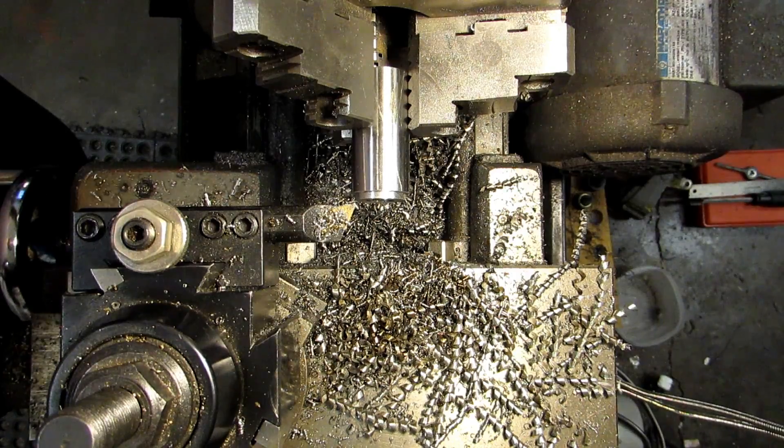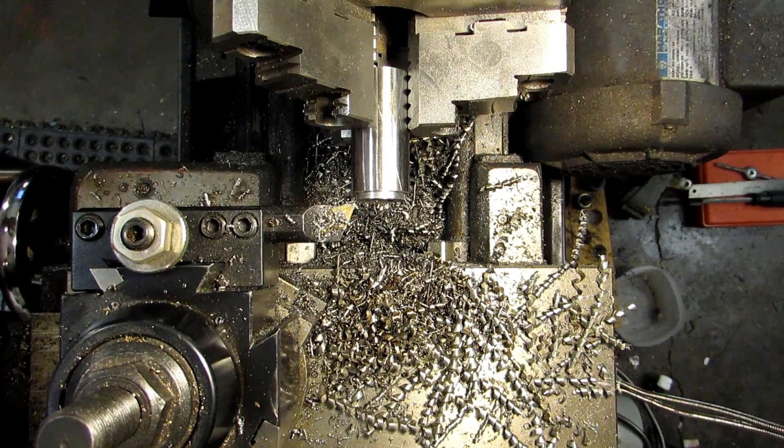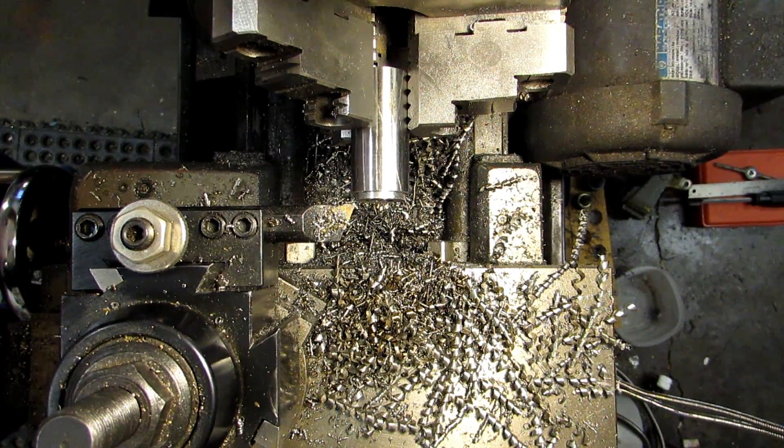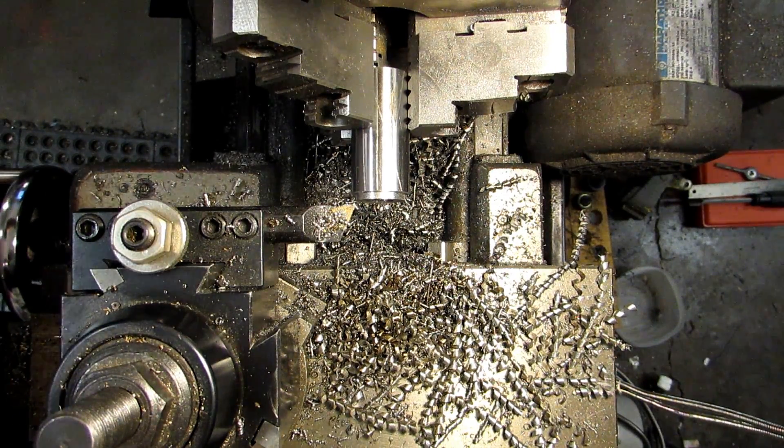I'm at 968 and probably four tenths, so I can input that into the digital readout. If you don't have a digital readout, don't feel left out — you can zero the dials on your cross feed and set up magnetic indicator bases. I'll show you all that on the next piece, the shorter of the two extensions, so you know how to do it without anything fancy.